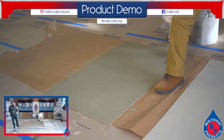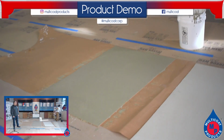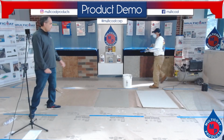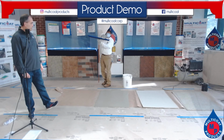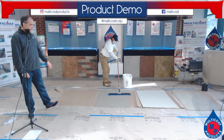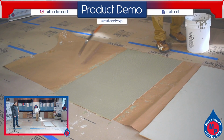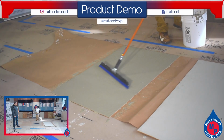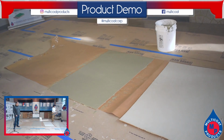And like I said, if you buy the magic trowel, you can do everything Alfonso's doing right now, but standing up, much easier for your guys, especially if you're doing a lot of square footage. There's the magic trowel right there. So as you can see, it's an easy application, easy to smooth it out. Much easier on your guys standing up, especially if you're doing large square footage. Depending on the climate where you're working, this product doesn't take long to dry and cure.